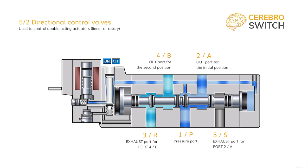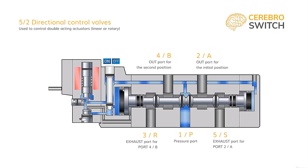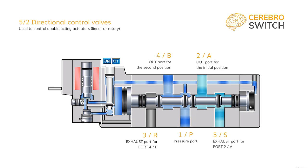And when the other command comes in to pressurize the other piston spool, it opposes the force and overcomes it. Look at the difference in size between the two pistons and you'll see the commanded one is bigger and will be able to push against the smaller one. We are calling this differential command.